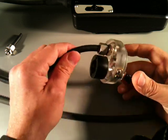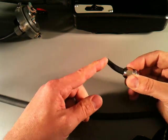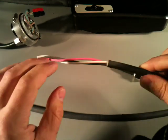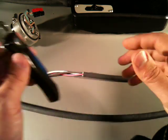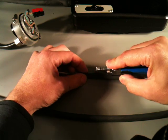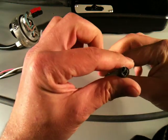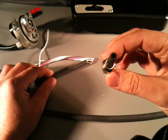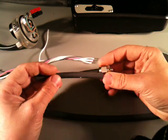These got better over time. There's a company in Europe called Agro that makes quite a nice cable gland with a rubber boot on the side, and you'll see those on a lot of lights now. Most companies seem to be using those. But the problem with all of those cable glands is the cable is like a pipe — if anything happens to the cable sheath, it's essentially just a hose pipe. Clear shot all the way through — any damage and the water runs all the way through. These cable glands are also straight through, so potentially any damage goes straight into the light head.